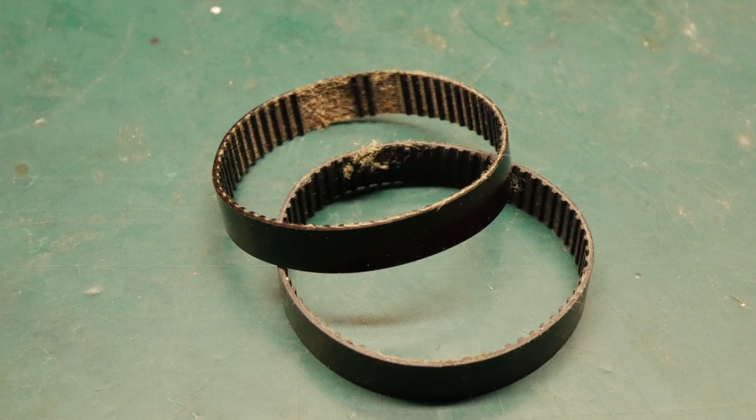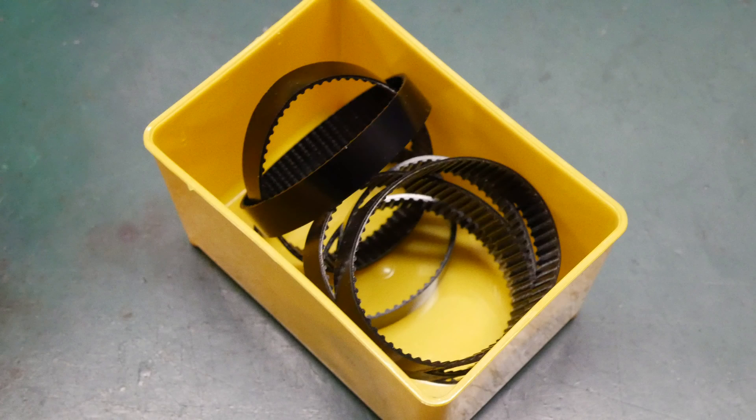The machine's been pretty well cleaned. Little items have been fixed here and there as I've gone along. One item that was noted was that the belts that attach the stepper motors to the ball screws had several teeth just stripped off of them. So I began the process of searching the web to find new belts and actually did find a source, but of course they had a minimum order. So if anybody needs belts for their DM2800, give me a call — I have a few extras.